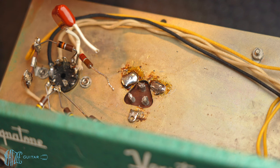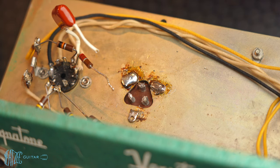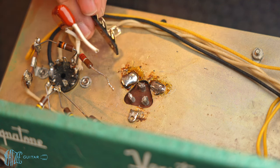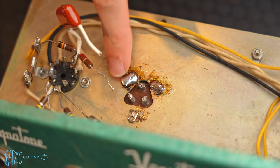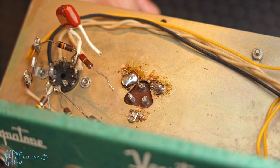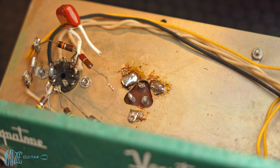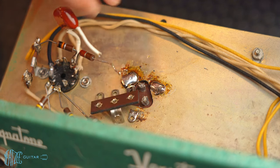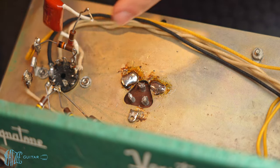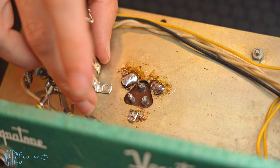I know the best way to do it obviously is to have it screwed in somewhere, but I don't want to drill a hole into this. Maybe I do this and I get comments saying I'm doing this wrong, which is very possible, but again, it just seems foolish to me to connect the terminal strip to one of these pins here. And then if the can cap gets banged or something, that could move, lift it up off the chassis, and then I'm kind of back to square one. If it's completely separate, and I just have a really solid connection to ground, so I sand it down, have it just bare metal, connect that on there. I think that should be fine.